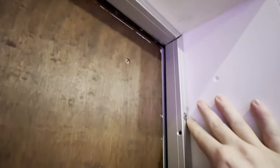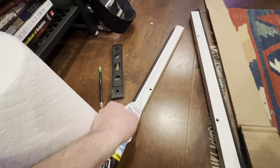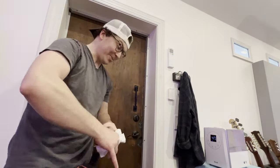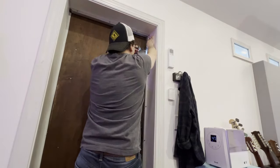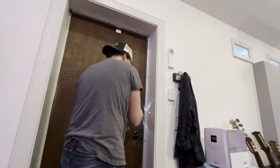I'm going to close the door. With the door closed and me pushing against it and getting it where I want it to be, it's much tighter. I'm going to put some acoustic sealant all the way along the back of this and then drill it in. I made sure I'm putting it on the right side this time — don't make that mistake. The seal is what matters. The seal is looking good across the door here all the way down.